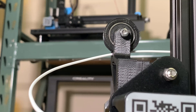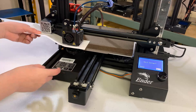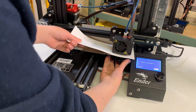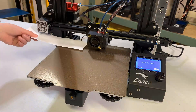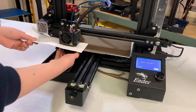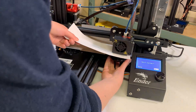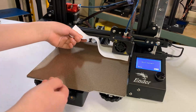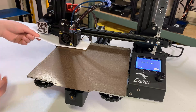If there's no clogging inside the hot end and nozzle, we're all set. Now we need to level the bed again, as the thickness of the print surface is different. Do the same paper test and level all four corners and the center. I will show you how to add the bed-level corner feature in Marlin so the print head can move automatically to all four corners and the center of the bed. I will show this in the next video, as we will add more upgrades that require firmware changes, and we will compile our own version of Marlin.